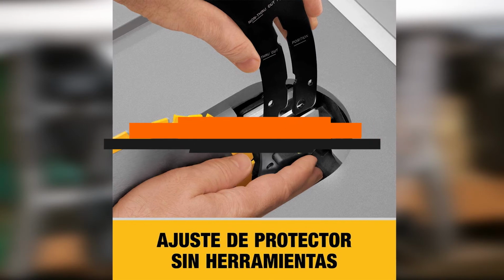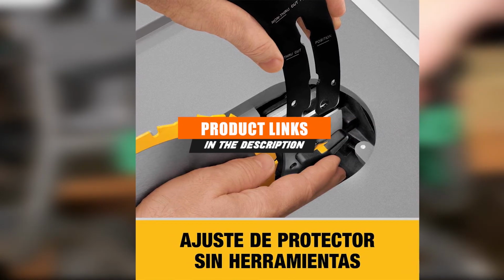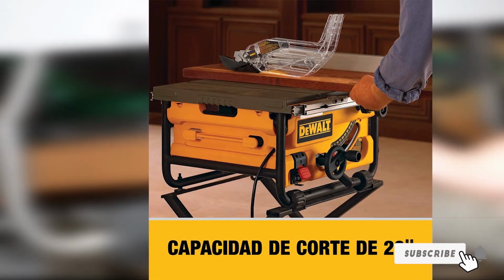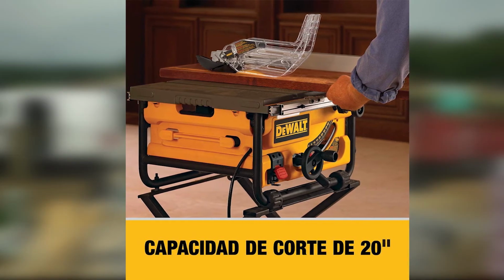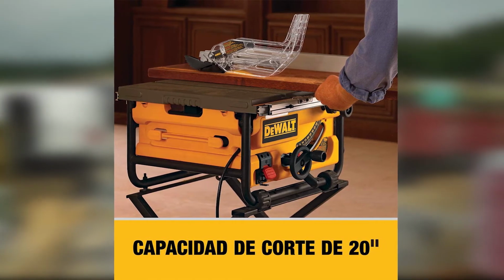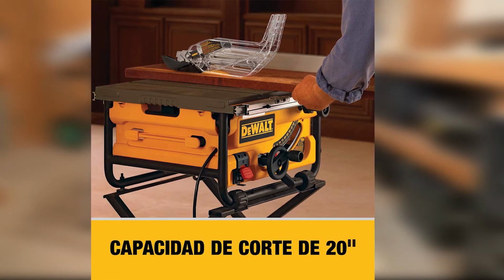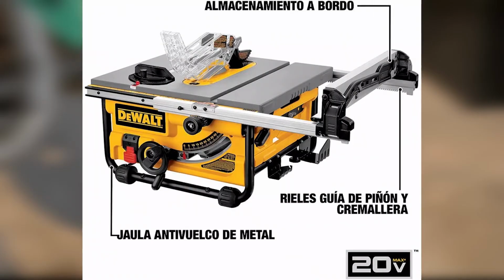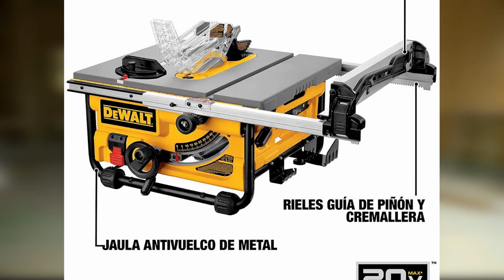This DeWalt table saw has a 10-inch blade and a maximum RPM of 3,850, created by the powerful 1,850-watt motor. It has a smaller rip capacity compared to the FlexVolt, but the trade-off is that there is no need to buy a separate charger. This saw is lightweight, weighing just 45 pounds. It is compact, easy to store away, and simple to use, ideal for taking it to the job.